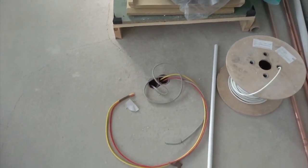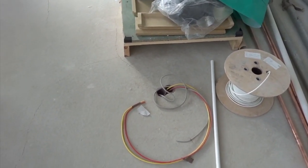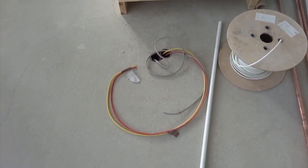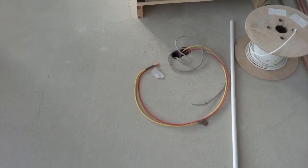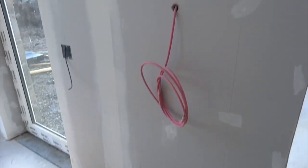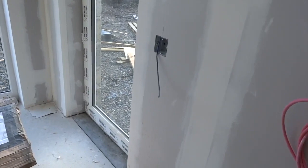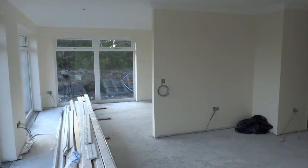And then we're going to be putting a floor box in here — the conduit's there, it's being pulled through. That will just be cut out and the floor box fitted in. This means we can put a table above it for a telephone or whatever, so you don't have to have a cable strung across the floor. We've got another voice data point back here and our final rear speaker. There's a door to the outside — again, light switch — and we continue through to the open plan kitchen diner area.